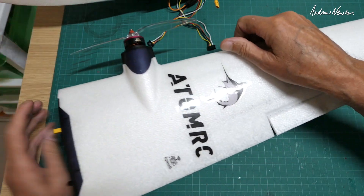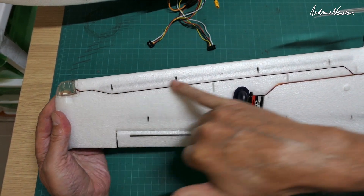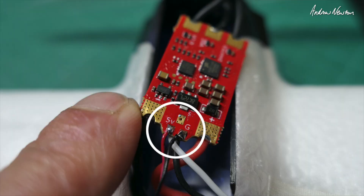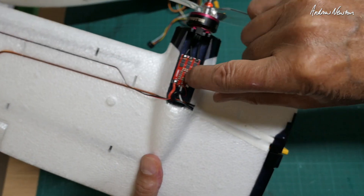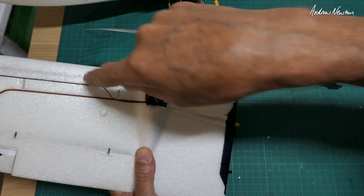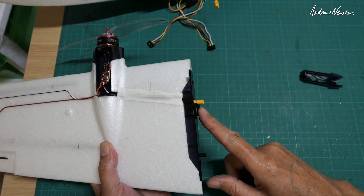Starting off with the wing and the LEDs — the wings are detachable, which is a very nice feature. LEDs on the wing tips, you can see the wire comes down here and runs in here, and the wires connect into the ESC. There's an onboard 5-volt BEC on the ESC, and you can see the LED negative and power go to the ground and 5-volt pads there. There's also an ESC signal pad there — that's the white wire. The signal wire and ground come back to the flight control board.